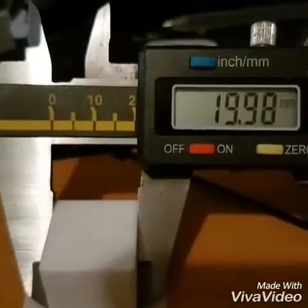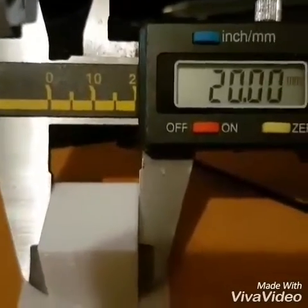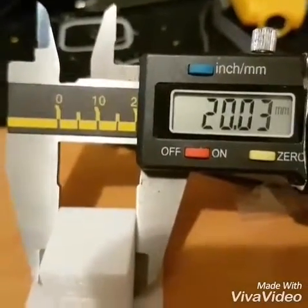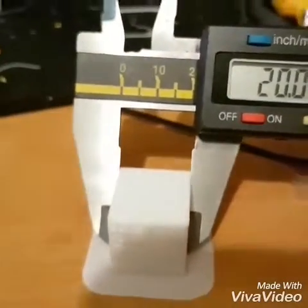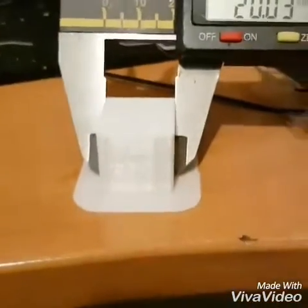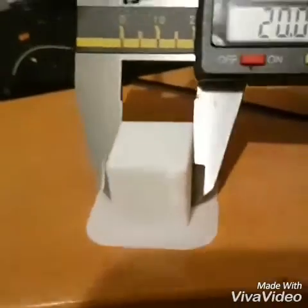So there are the new steps per millimetre — a bit happier with that. It was 20.3mm before. The width is now 20.2mm, and that's the sort of finish you can expect from it. The height was right before too. No more lifting — happy with that.